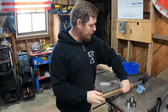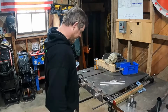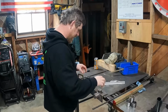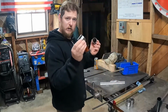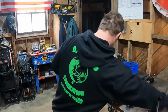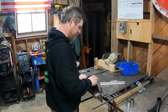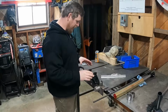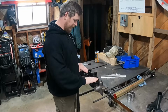And then the second time I built them was for the last Mega Moto, and I made this fixture. This fixture has these posts on it that I machined down to be the right size, and they hold the collars for the fork. So they go on there, and then your triple tree goes on here, and now you can see how much our offset is going to be different. You can see here that our offset is way off. We have to make an entirely new plate for this top piece,